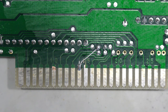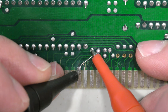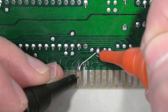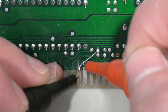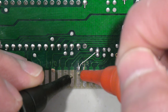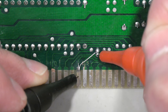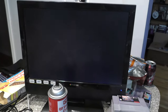Here's where I use the multimeter — just test around my patch to make sure nothing is bridging and nothing else is being touched. Like I said, maybe a component leg isn't the greatest solution, but it's what was right in front of me on my workbench. I had a component leg just sitting next to me so I grabbed it and used it to patch. It's just a little bit of ingenuity — if you have what you have on hand, you can use what you have on hand.